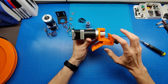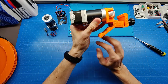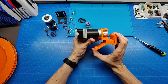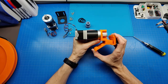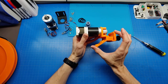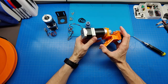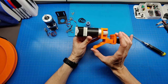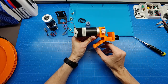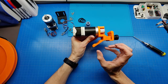And then the distance, this surface is actually very critical in this part design. It depends on the actual dimensions of each specific Dobsonian mount, which is what makes this specific part incompatible with, say, an 8-inch telescope or a 12-inch telescope. So this specific piece was developed for a 10-inch mirror telescope, which has a 12-inch tube.